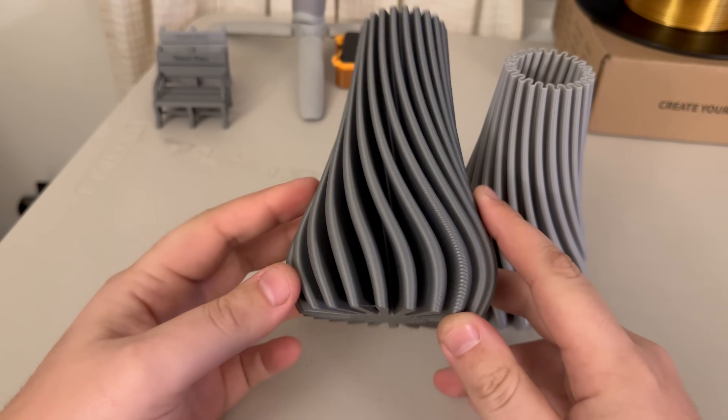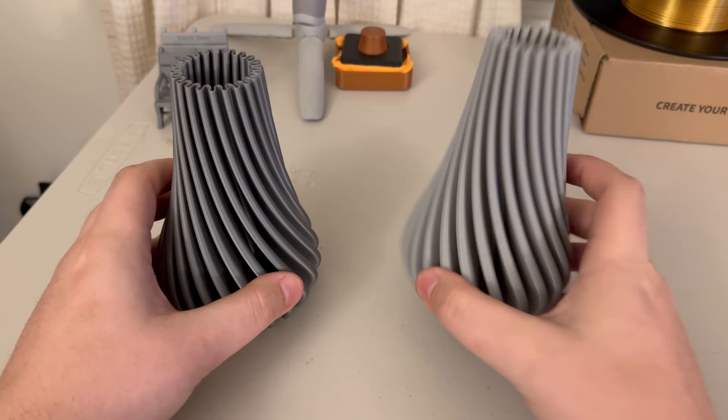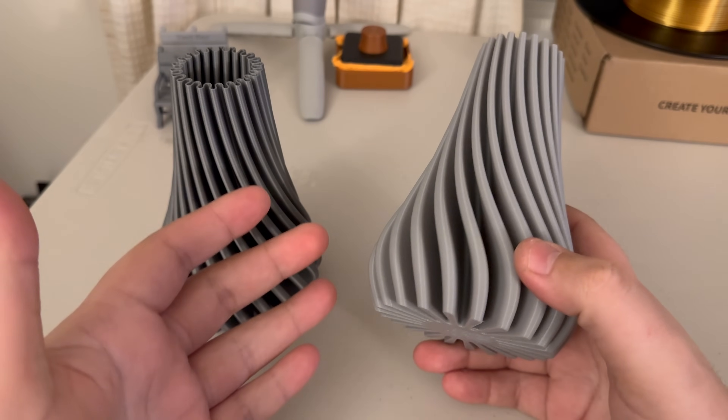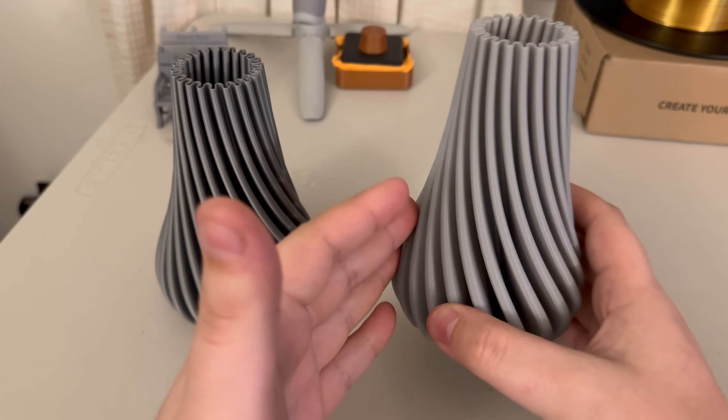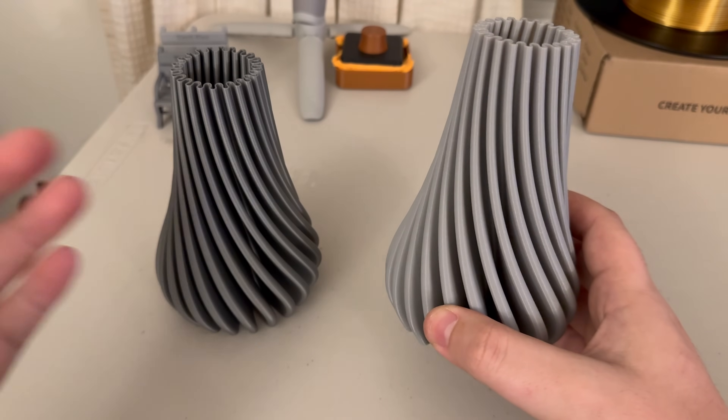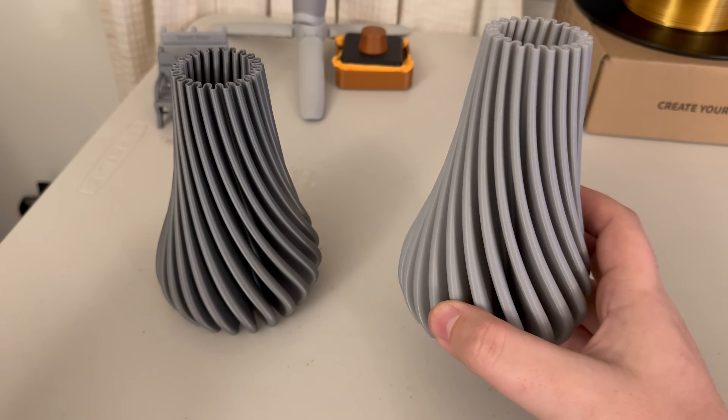So it's really going to come down to where you're using this and how you're using it. For PLA or PLA silk it'll look great, but if you're going to use this outdoors, in a heated environment, or anything like that, you'd probably want to use PETG so that it doesn't degrade quicker and you're not looking at any degradability issues at that point.